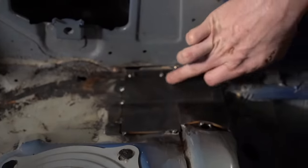So we've scribed our tube at the one end and cut, and we've already notched the tube on this end, so we can do one of two things. Since the tube is just a little bit too long, we can either recut the angle at that end, or we can just increase the size of this notch by moving in a little bit, which will shorten the tube both ways. In this case, you just do whichever way is easier, which for us is going to be just to recut this straight edge on the bandsaw. Just cut the same angle again, remove it, going in about a quarter of an inch, and yeah.